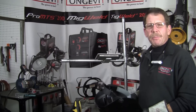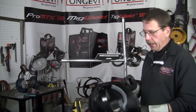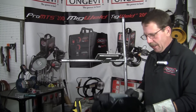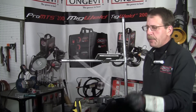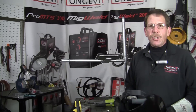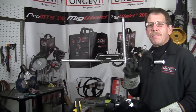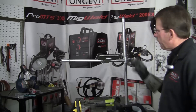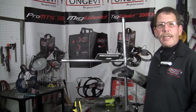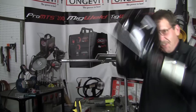I like shade 11. I've got the little magnifying lens in there too — the Elite hood has a little slot right there and you can put what we call a cheater lens, a magnifying lens, along with the darkening lens. I'm going to be using a 53-56 rod, eighth of an inch. I'm going to be using eighth of an inch tungsten. I've got my Argon set to just about 25, a little less than 25. Keep everything clean — and I'm sitting down, so it's at about chest level because I'm going to sit on the stool. Let's do it.